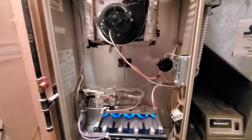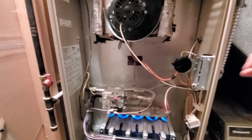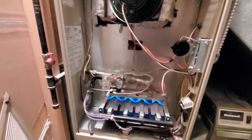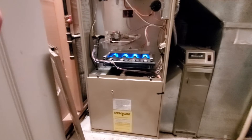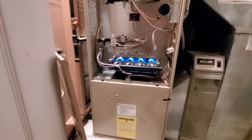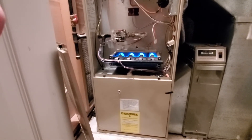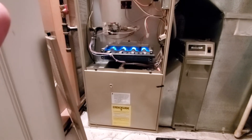A couple of lessons here. First, you can run your furnace with this problem as long as you pinch the vacuum tube long enough — just pinch it for a moment and release it. It'll pull enough vacuum through the induction motor to start the furnace as long as it's calling for heat. If you're in a cold house and need heat, you can at least manually start it. It'll kick off when it reaches temp and you'll have to restart it, but at least you'll have some heat.